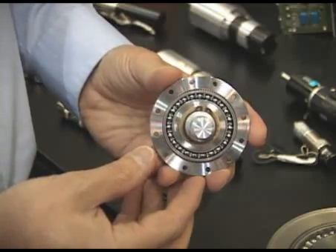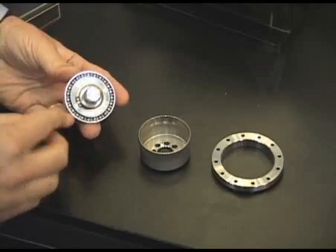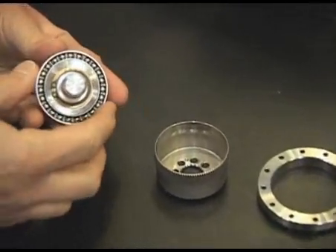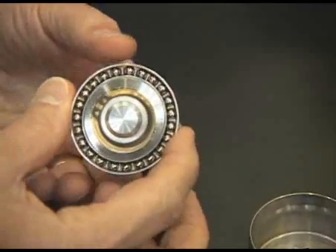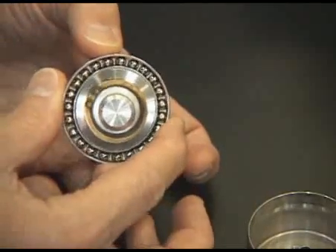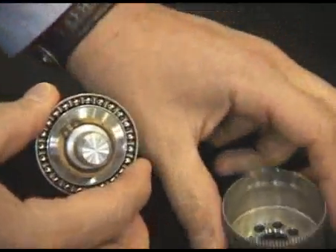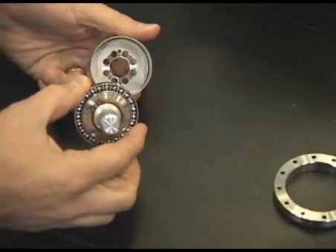It's made of three simple parts. The first member is what's called a wave generator. It's a thin race, specially designed ball bearing, which is distorted into an ellipse by pressing an elliptical plug into the center. You can see that if I squeeze on the outside of the bearing, I can get a rotational motion there. This serves as the primary mover of the gear system, and typically this is where your servo motor is attached.